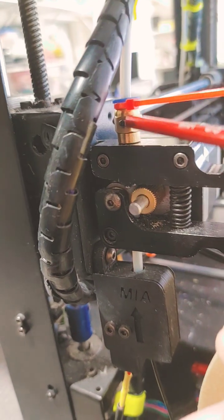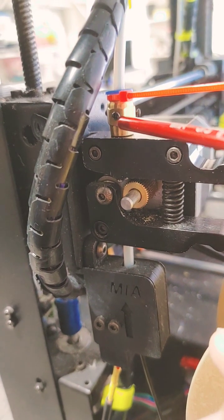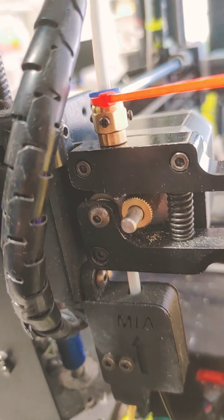So drilled three holes at 120 degrees — that is the tip — and you can thread that, and the screw itself buries itself a little bit on the surface of this Teflon tube and it really grips it. This is not coming out anytime soon. I'm pulling this as hard as I can and it's not, because those three little screws are actually putting pressure on.